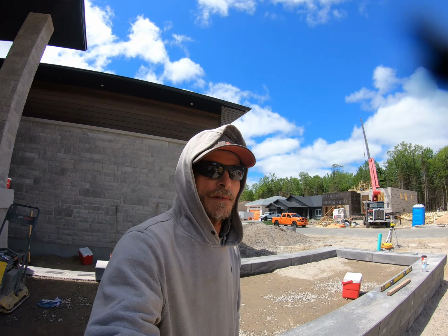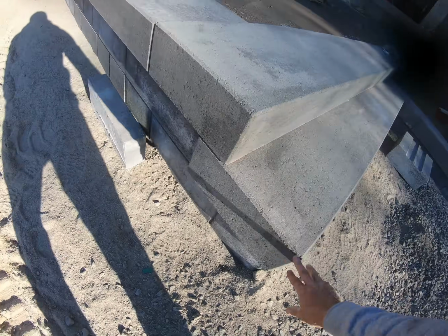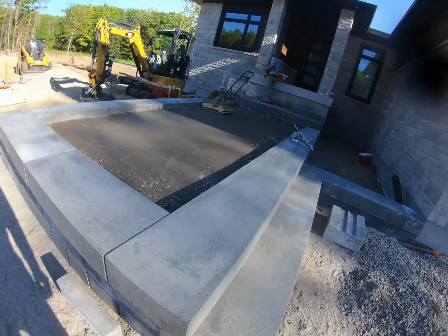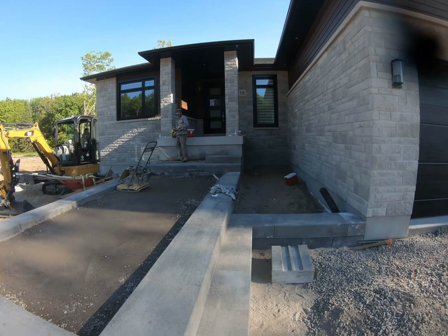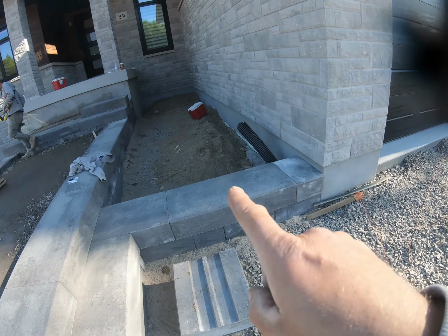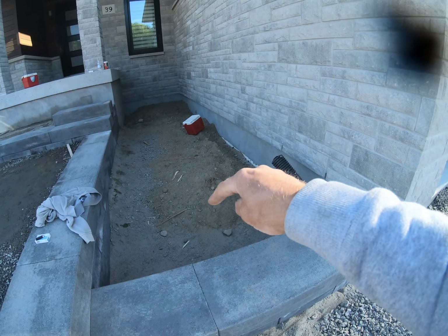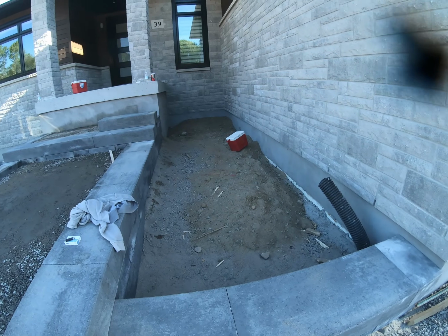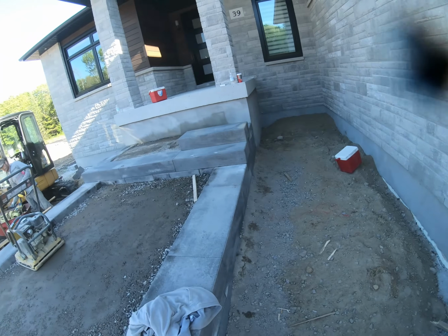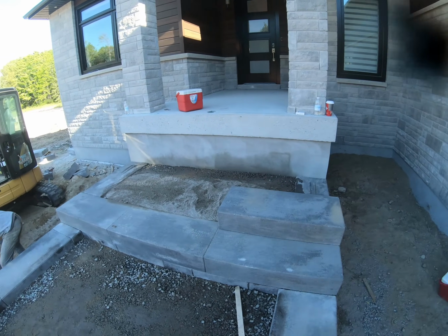We'll check back with you after. So, into this day. Oh, we got our first step coming in here. Everything's all tied in. We got more steps going in all the way up, total of 4. A little wall here, a little high in the masonry, but they wanted the wall, so we're going to leave that lower and connect the weeper all the way around to collect any water. We've got 2 more steps after this one, which will be tomorrow.